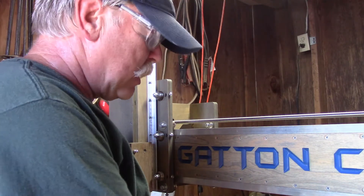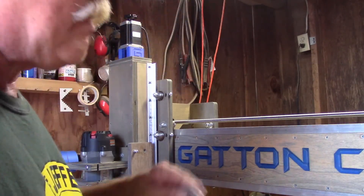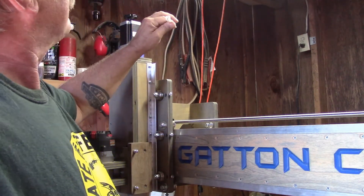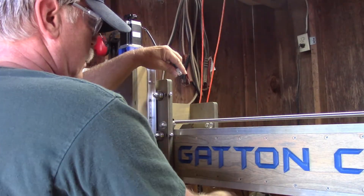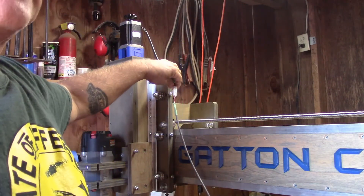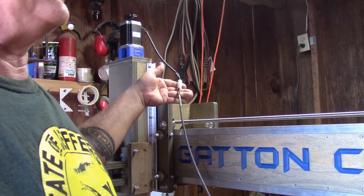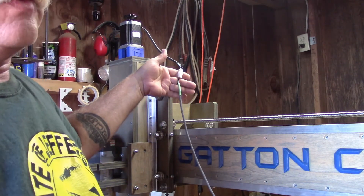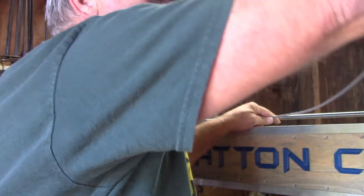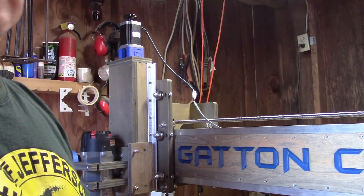I'm going to hook up my Z axis first, which means I'll get this axis cable separated from the X. I've got a male and a female plug here on the extension cable, and a female plug up at the motor. So I'll plug the male extension in here. These are keyed a couple of different ways — they're almost, but not quite, 100% Murphy-proof. If it's not slipping together easily, turn it — you're trying to plug it in wrong. And there's my extension cable running all the way across the gantry, and now I can plug that end into the cable coming out of the drive box.